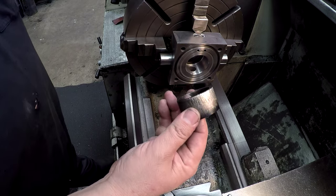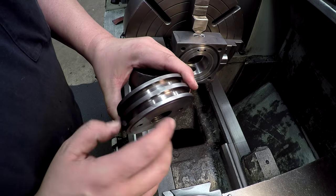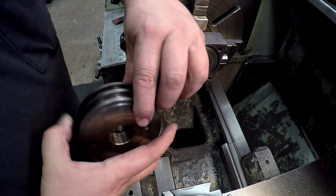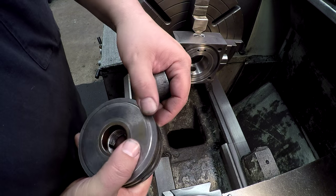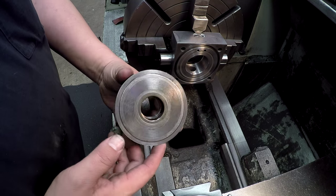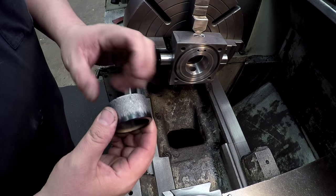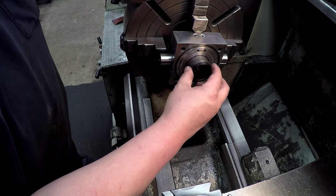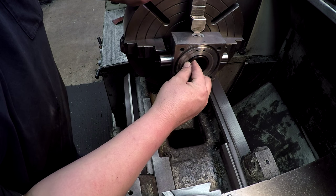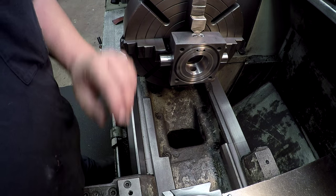So sometimes there gets to be a lot of wear. This piston has got a lot of wear. I know it's hard to see, but like these edges, you have a lot of rolled metal on these edges right here, really sharp. It's got a lot of wear. So this is where it wore way undersized. I have to build a new piston for it, and then we're gonna make a new cushion. It'll be the same ID length. It's gonna match this right here with, you know, you'll give it enough clearance so that it doesn't jam and hit. You go up in there and restrict it. So that's it. All right, see you on the next job.